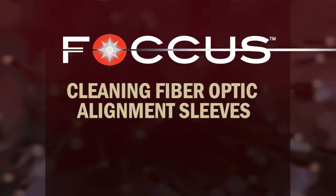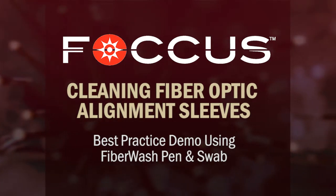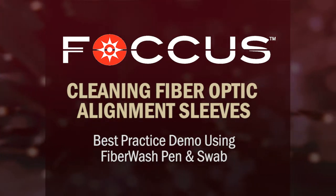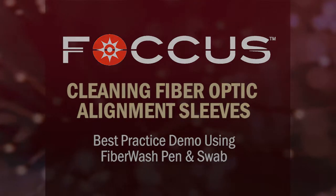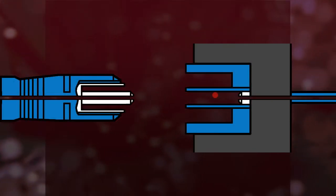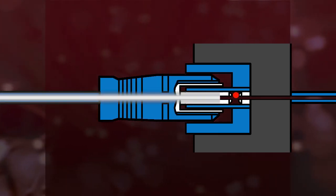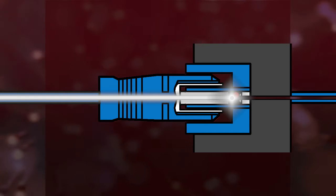Let's get into the best way to clean an alignment sleeve in a fiber optic bulkhead, in this case for 2.5 millimeter connectors. The importance of cleaning the alignment sleeve is often overlooked. If residue is allowed to collect in the sleeve, it could throw off the alignment or even migrate between the end faces, impeding the optical signal.